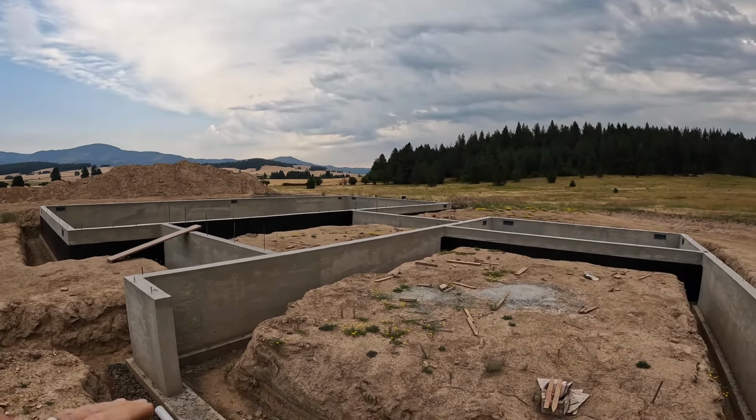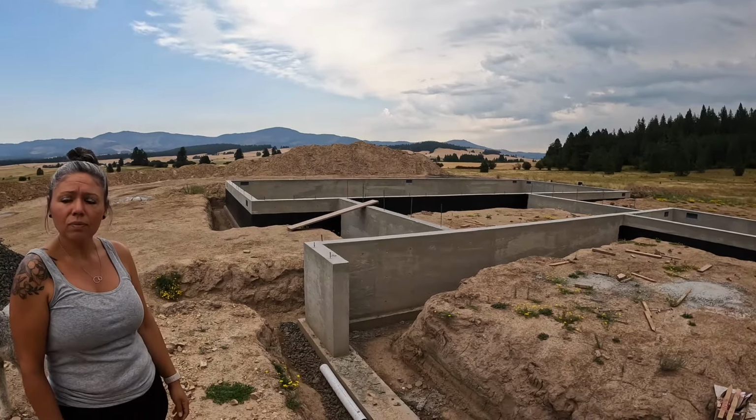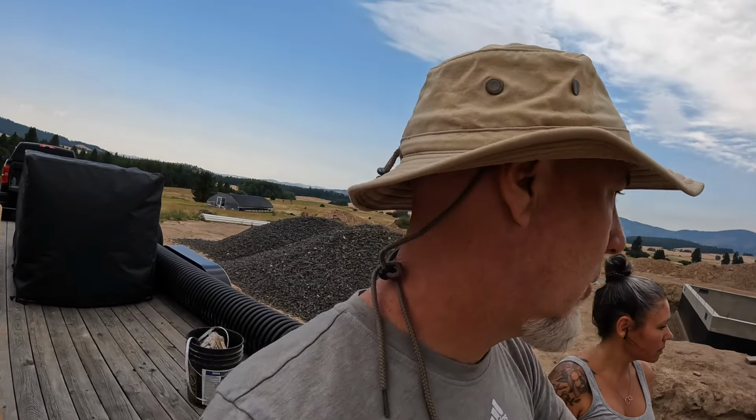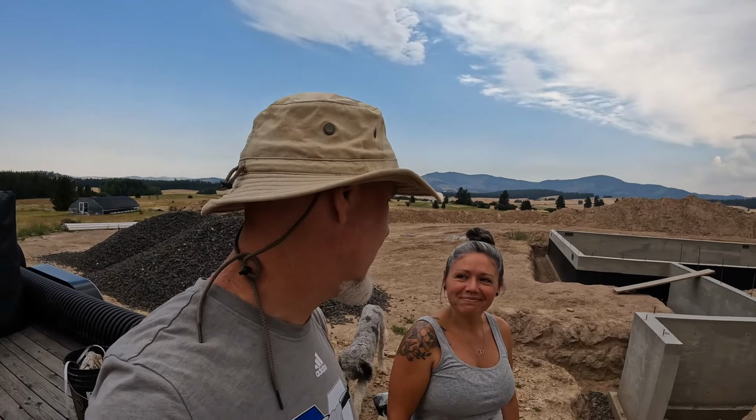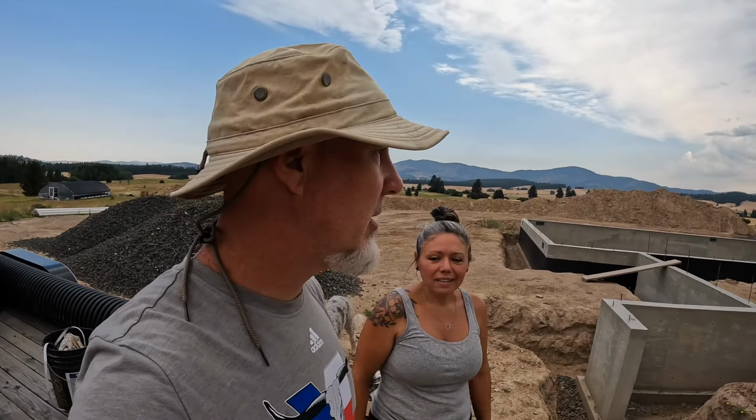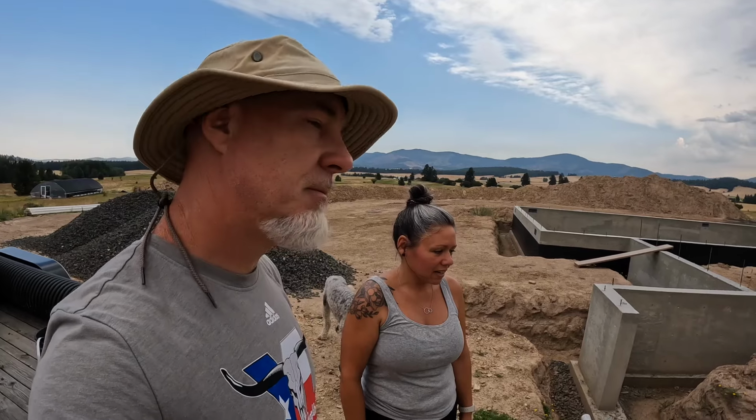is going to slope downhill, and then that corner of the house is going to slope downhill from there too. So we're going to dig that down just a little bit to see if we can get some fall, and that way all the perimeter drains around the whole house are going to be kind of level, and then the water will just work its way out as the pipe fills up and start falling right there, which gives us a little extra support. So we're gonna start doing that. We'll see what we can get done.